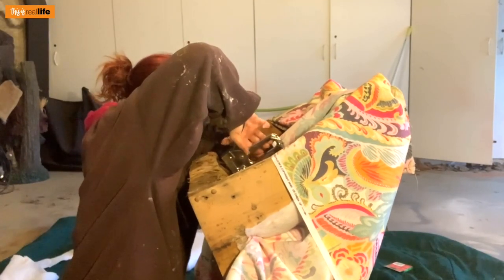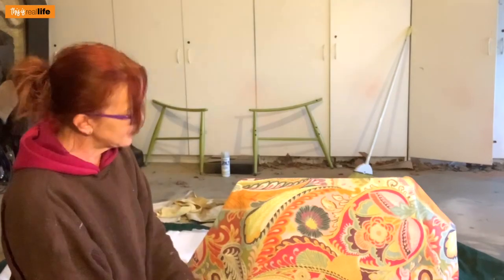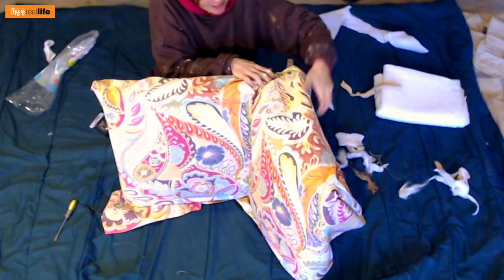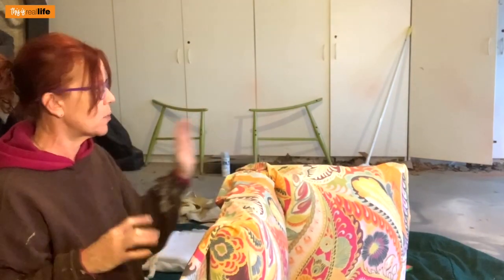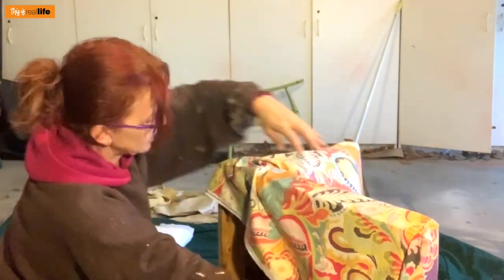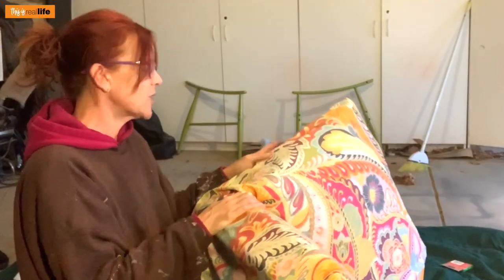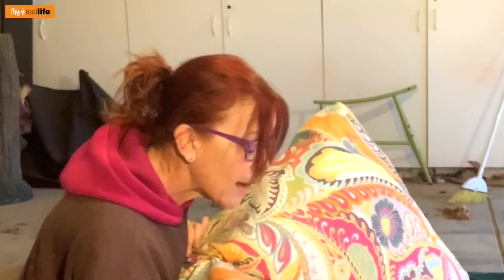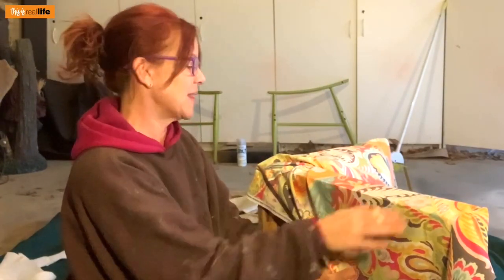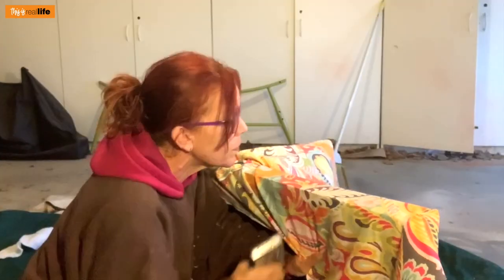It took forever, but I finally got the fabric shoved in. From the back side I can take this fabric and staple it to the piece of wood. I kept it all one solid piece — I didn't cut separate squares for the seat and back because it would be too hard to shove two pieces between there. For the corners of the seat, I pull the fabric nice and tight, staple in the center, staple in each corner, then flip and do the same to the other side. Thankfully I didn't pick a stripe or squares — pattern matters when recovering a chair.